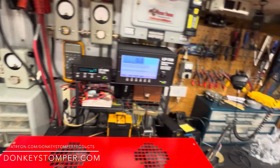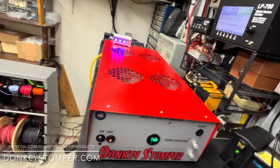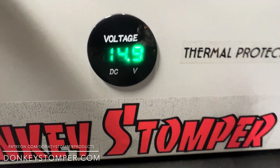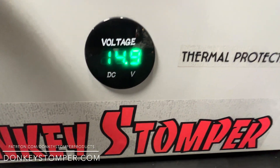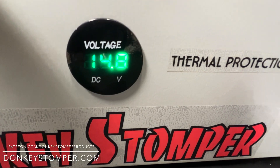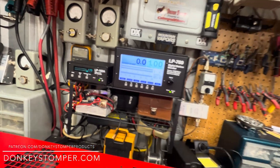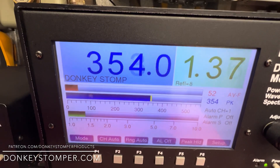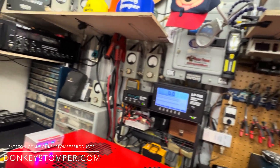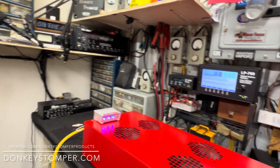The little plug-ins really shouldn't run out much power on them, but I do because I'm lazy and I don't want to be screwing and unscrewing on videos. Keep in mind that the wattage you're seeing is on 14.8 volts — not bolted down — and sometimes I get them on 15. It just depends on what kind of supplies I come up with, but I lock them down like this. They just last longer — the longevity is better. That extra little bump of wattage ain't really that big a deal; can't nobody hear the difference. That's just like driving the snot out of this — you might put a four pill on it and get 3,400 or 3,500 out of it, but nobody's gonna hear it. The only person that's gonna know it is your pills.